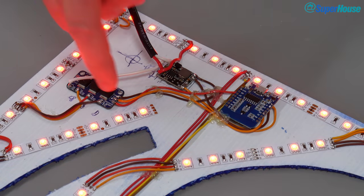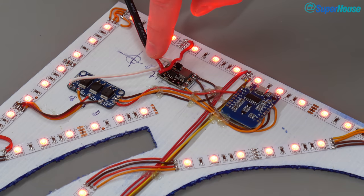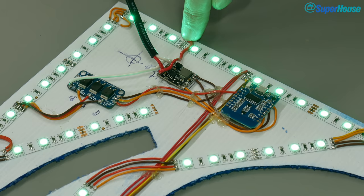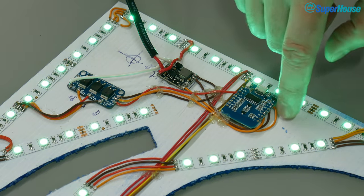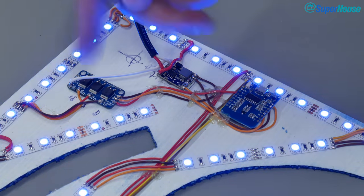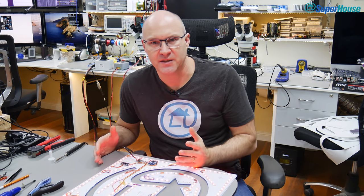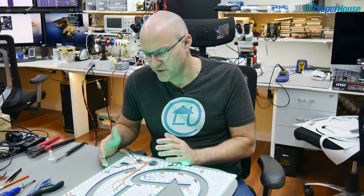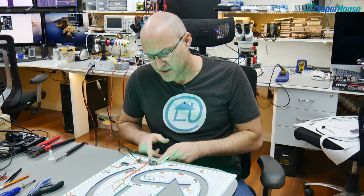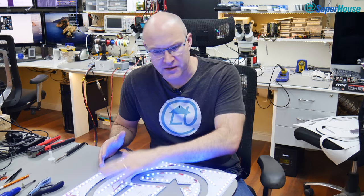I've got three channels and the three MOSFETs are switching the three different color channels. I've also added a little 5V regulator. So 12 volts comes in on the main power line — the raw 12V goes to the RGB LED strip and a common ground goes across to the module, but I get 5V out of the regulator to power the D1 Mini. The D1 Mini sends data to the module to control the LEDs. Effectively from a software point of view, this whole LED strip looks like a single addressable LED, which means I can address it using the exact same driver software as NeoPixel or FastLED library. It's also supported by Tasmota — I've got Tasmota running on the D1 Mini with the output set up to tell it that it's a WS2812 controlling the module, which then controls all the LEDs.